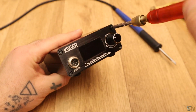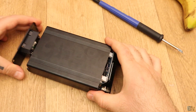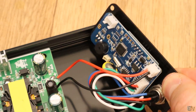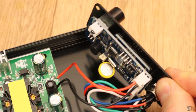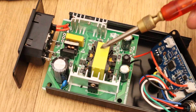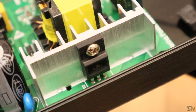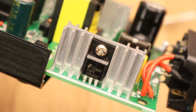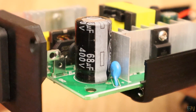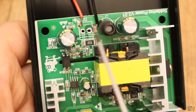So I take out 4 screws on the front part and 4 more on the back part. At first sight, we can see the controller board with the OLED display here. Two transformers — a big one and another small one — and two heat sinks with some components. One of these components is a Schottky rectifier and the other one is a power MOSFET. We also have a huge capacitor at the input and, as you can see, we have a photocoupler to insulate the high voltage from the low voltage part on the PCB.